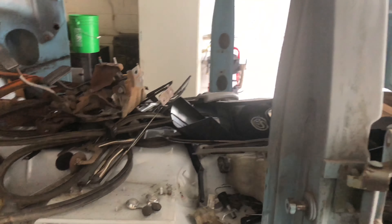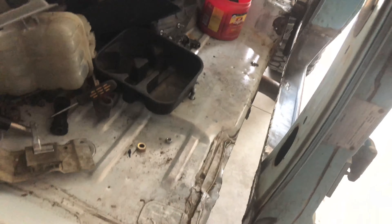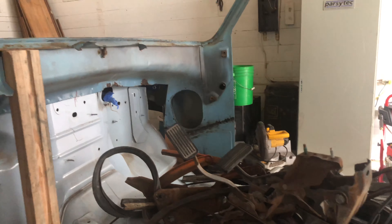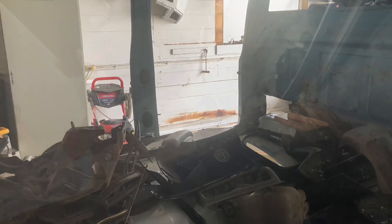The next step is really just finishing out all the welds. I used angle iron here because this is just a support, and in the back it's not even welded — just a piece of scrap block tack welded in to keep it from shifting side to side. But I need to fill in every bit of this. It's a bigger gap than I thought, so I'll have to figure out how to make it structural. I'm going to start cutting out some metal and welding some beads and see how she turns out.